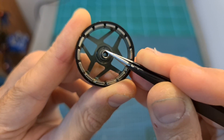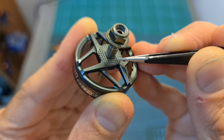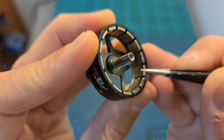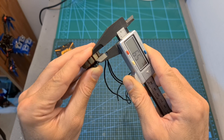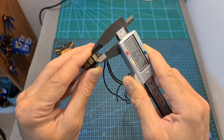In order to reduce weight, the motor bell is using a hollow shaft. On its top side you can find the usual grip pattern for better securing the propeller, and inside the motor bell you can find 14 magnets. As for the stator, its diameter is 28 millimeters and its height is 6.5 millimeters, so the T-Motor F90 are 2806.5 motors.